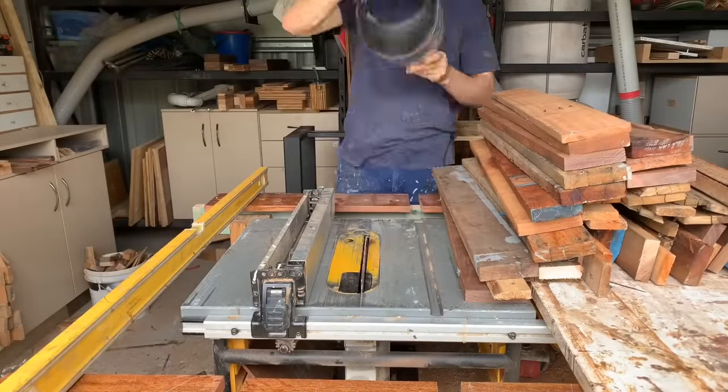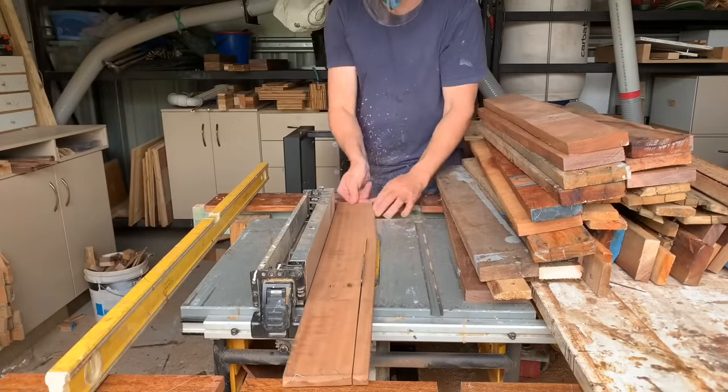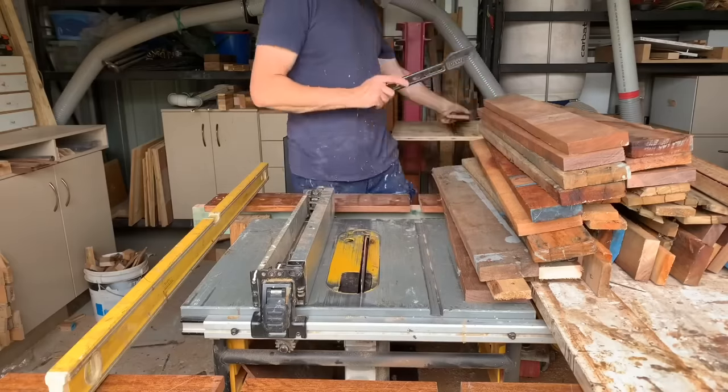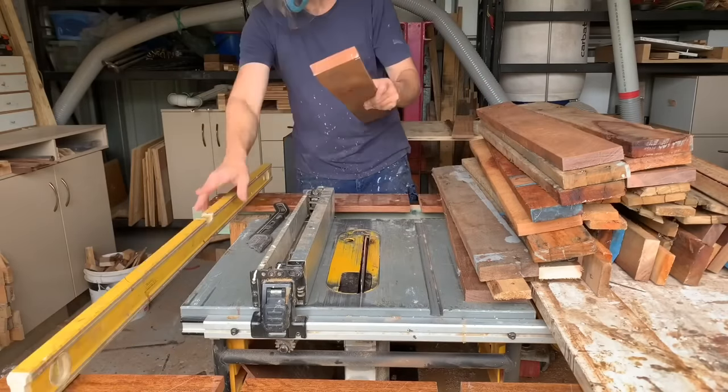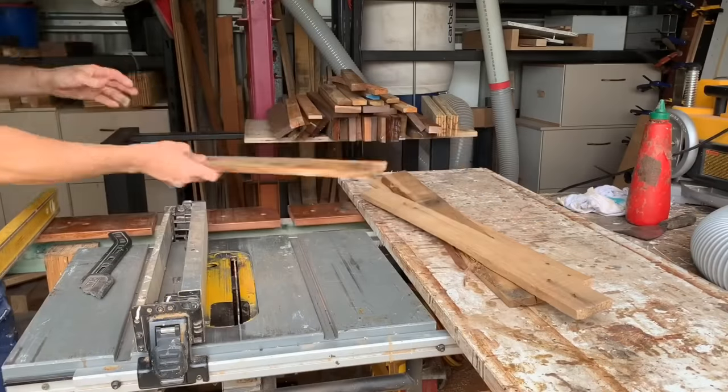On this project I've got lots of timber that may be warped or not perfectly straight. If it doesn't have a straight edge I'm going to put it aside and come back to it later with a straightening jig. If it is good to go I'm just going to run it through the table saw to get my initial thickness of the slabs.